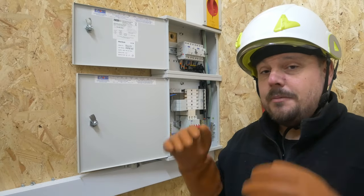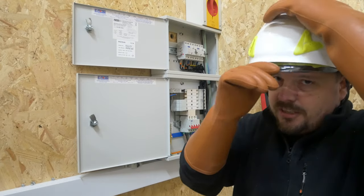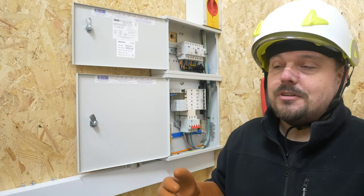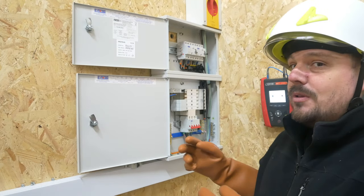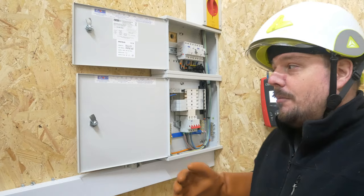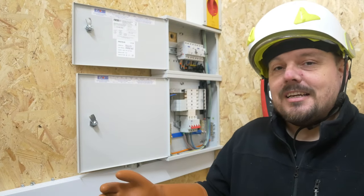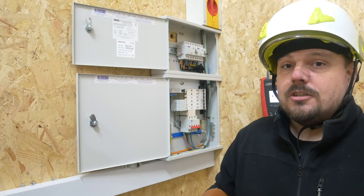So you can see I've got a bit of extra PPE on. I've just got the inner rubbers and my little arc flash helmet with its shield. It's over the top for the incident energy that's down here — I know this because I've run these calculations through Modesoft Electrical OM, which has the bolt-on arc flash studies. So you can do that as part of your software and you know exactly what kind of PPE you might need. If this was a much bigger switch room you could have to wear full overall suits.